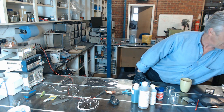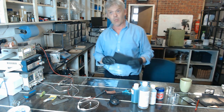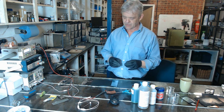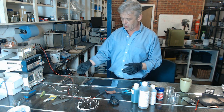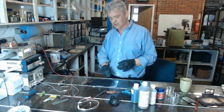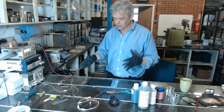Now there are two ways that we can plate something. One way is called wand plating — or brush plating — and that's very popular. You essentially don't use a bath; you connect your negative to the thing you're going to plate, your positive to the wand, and then you rub the wand over with a bit of solution and it will electroplate. And we've been doing exactly the same thing.